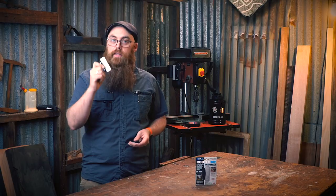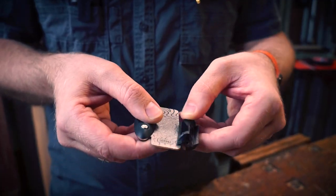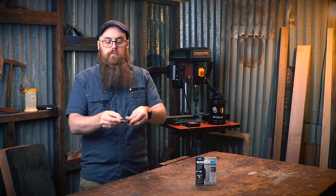Sharpening your bits with Empower's router bit sharpener is very easy and straightforward. You literally just hold the sharpener in one hand and the bit in the other, and run the bit along the sharpener three times — firm, firm, firm — then do the other cutter the same way. Then flip it over to the fine side, the 600-grit, and do one-two-three, one-two-three.